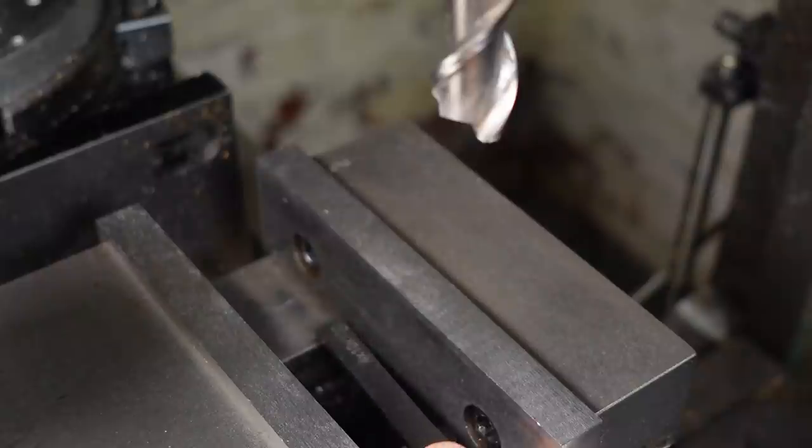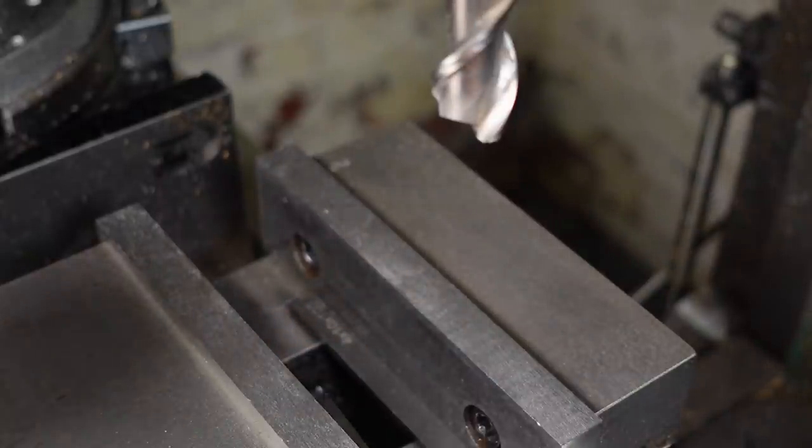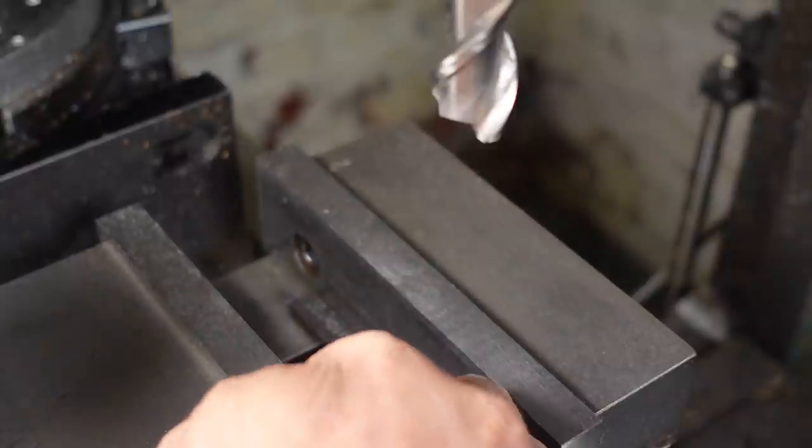The spigot sides of the clamps need a different work holding approach. I'm using an ER40 collet block in the vise with a 20mm collet to grip the spigot shaft.